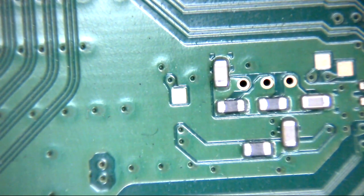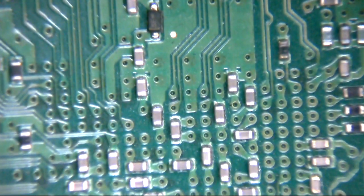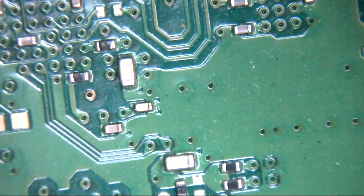So if we think it's coming from Southbridge, chances are that there's going to be something similar kicking around there. So this portion of the circuit here is the rear of the Southbridge. If we think there's a signal from the Southbridge that controls that, coming out somewhere, then it should be somewhere fairly close by here, you would imagine. Now on the face of it, I can't see an awful lot that it might be. I'm not convinced there's anything up there that's going to do it.